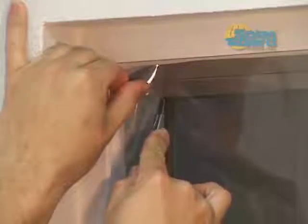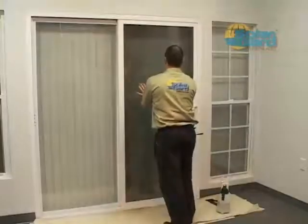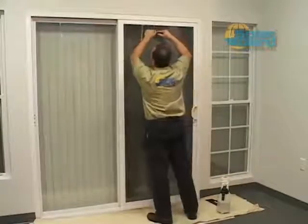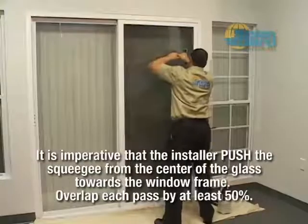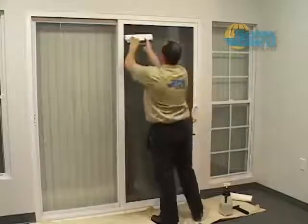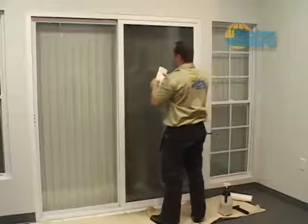With heavier films such as safety and security films, cut the film diagonally at the corner of the window frame at a 45-degree angle to reduce excessive creasing or crinkling as the film is set back into the frame. The primary difference when installing safety and security films is the amount of pressure required when squeegeeing — the installer leans into the glass pane using a power squeegee blade with an 8-inch crush grip handle for maximum leverage. The installer then uses a five-way tool wrapped in a paper towel with additional pressure to remove remaining moisture and seal off the edges of the film.